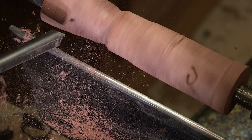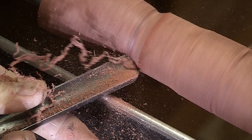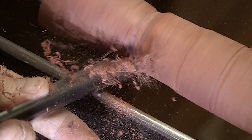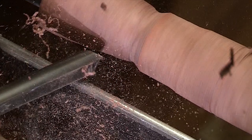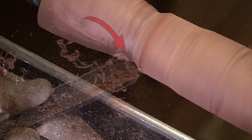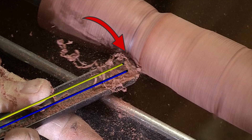Pretty cool looking in slow motion. Now let's look at it one more time really close up. You can see where the red arrow is — I'm starting to touch the edge of the tool that's not supported — bang, the flip happens. Now oftentimes the tool will win and the wood will break. In this case I'm using Purple Heart, which is really tough, so the tool lost. There's the edge that's touching — where is it supported? It's supported towards the front — that's the part resting on the tool rest.